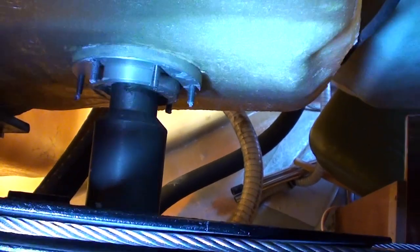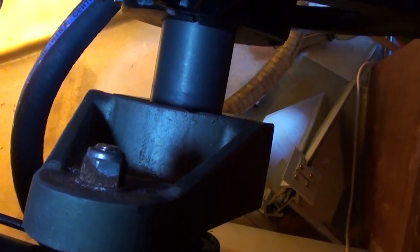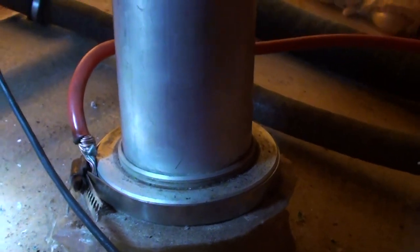At the top there you can see the top bearing, which was completely free and in good condition. When taking it out you have to remove all the fittings — they're held on with an Allen key and the top one is held on with a screw which clamps up the holding nut for the rudder itself. This tube also has a seal in it which stops any excess water coming up, and hopefully this will reduce the wear on the bearing.